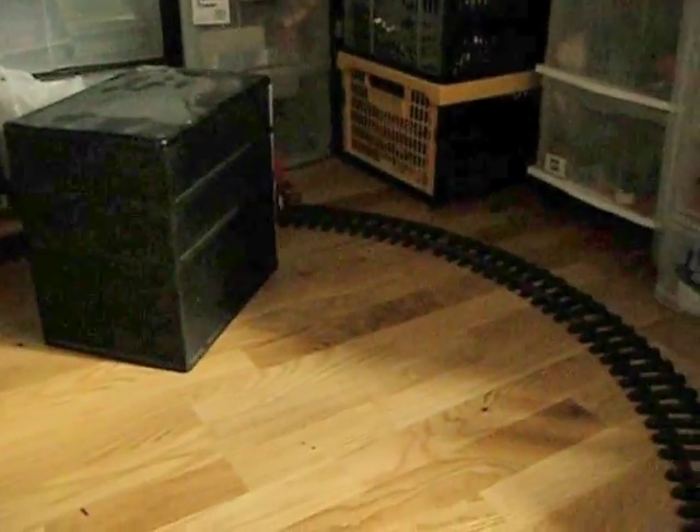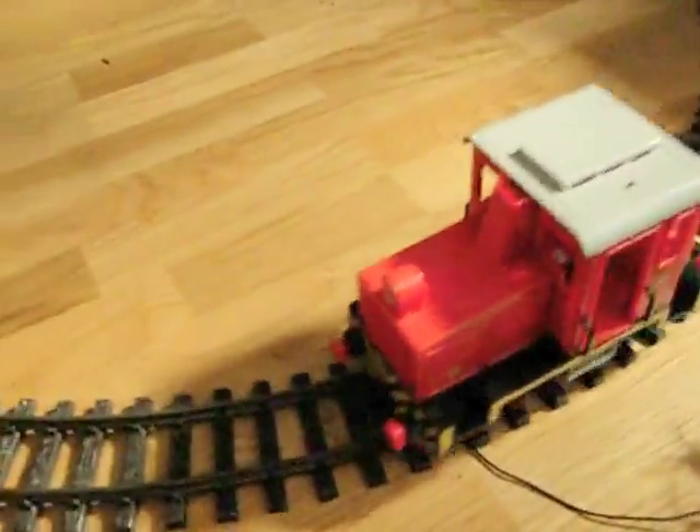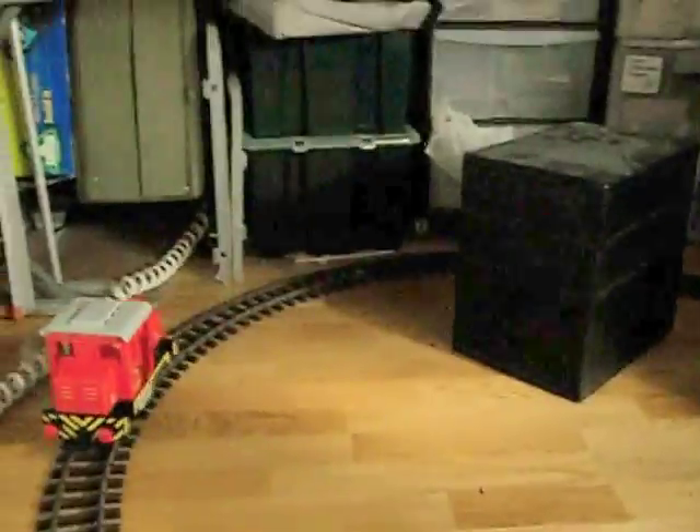It's amazing to think that you can move that train on a solar panel that's only 30 centimetres — it's on my other videos, you saw it at the beginning of this one. And yet there's the train going around on it. It's all down to that converter. When I put it straight on the solar panel, the train stops. That's a standard off-the-shelf converter, but modified to basically regulate input voltage, not output voltage.